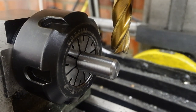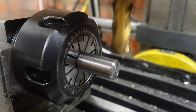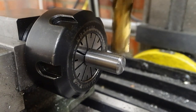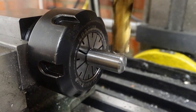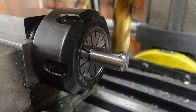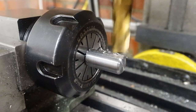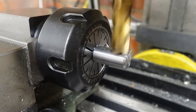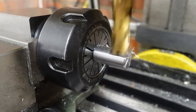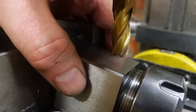The stud is going to need a hole in it for a key ring, so I can hang it from something. But a hole straight through a full round rod isn't going to allow me to put a small key ring through it. So bring that down with 2 flats. Just take 3mm off each side of the stud. Will give me a 4mm flat end that I can drill a hole through.